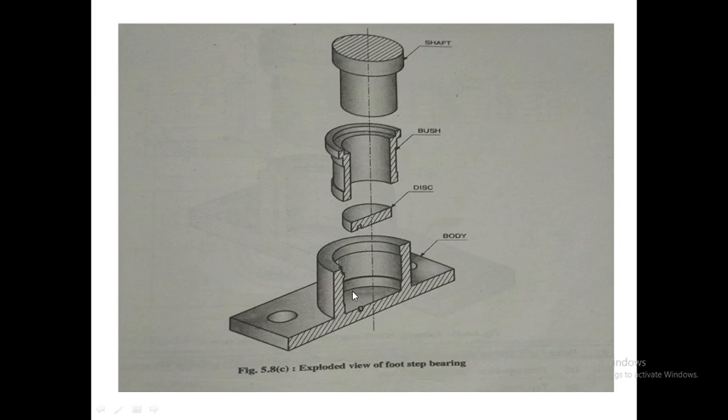With the bush locked, friction between the outer surface of the bush and the inner surface of the body is completely removed. Friction will still exist between the lateral surface of the shaft and the inner curved surface of the bush. If the bush gets damaged due to wear and tear, it can be easily replaced. Replacing the bush is much less costly than replacing the body.